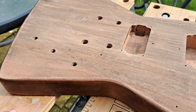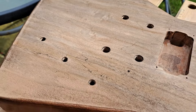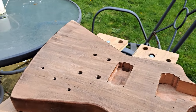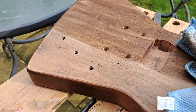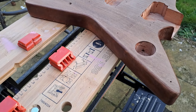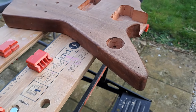I am pretty excited — after sanding it back I've done one sweep of dye and look, there's no line! So I'm gonna do one more coat and then two coats of shellac, and we'll see if eventually it looks a similar color to the rest of the body. There we go, nearly done. That's two coats of the dye done — time for the shellac.